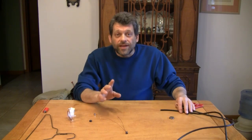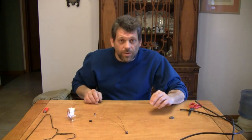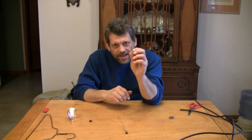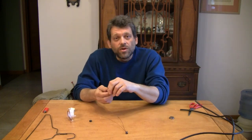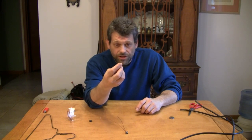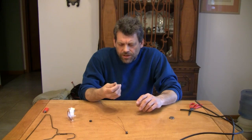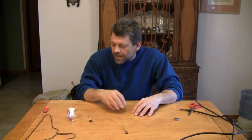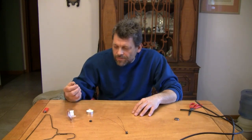I think it's time to get started. What we're going to be making today is a heat engine. Pierre Curie — a scientist who experimented with magnets and heat — discovered a long time ago that when a magnetic metal gets very hot, it loses its magnetic properties. Neodymium magnets lose their properties at a fairly low temperature, probably about 300 to 400 degrees for this particular magnet. Certain other metals, like iron, need to be heated to 700 to 800 degrees before they'll lose their magnetic properties. So in order to use a candle, we will need a neodymium magnet.